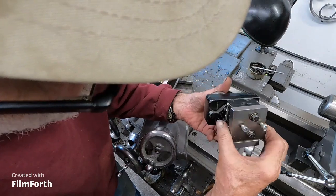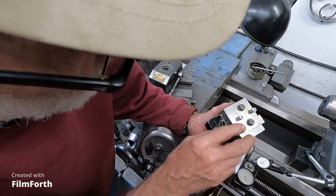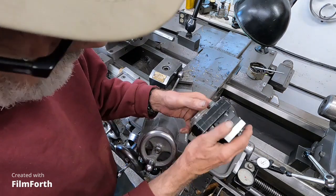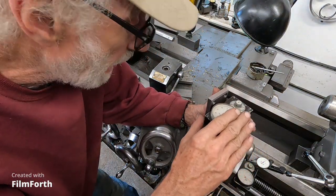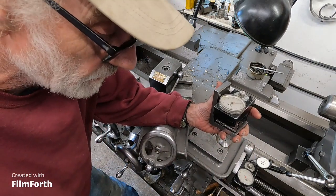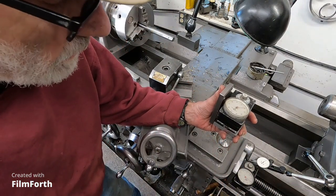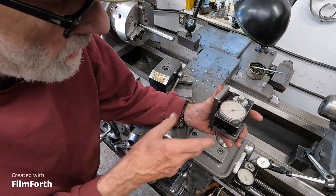And to adjust it, I'll take this apart. I'll set it on a board with these two bolts, okay? You adjust that yaw. And if it's off like that, what happens is if you travel back and forth across the distance of the machine, it won't return to zero because it's cocked and not tracking correctly. So you want these things to track correctly.